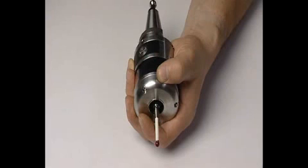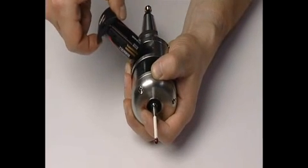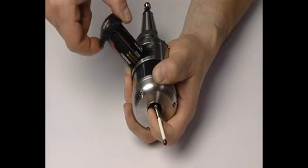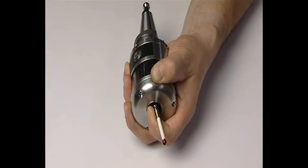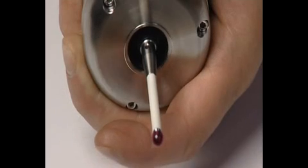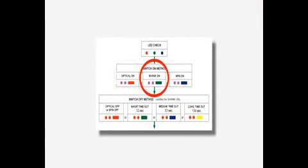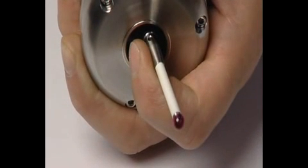To enter the OMP60 trigger logic settings menu, remove the battery cassette for 5 seconds, deflect the stylus, and, keeping the stylus deflected, replace the battery cassette. Once the review sequence is complete, 5 red flashes will occur. You now have the option to change each mode by deflecting the stylus for about 1 second. To move to the next option, the stylus should be deflected for at least 4 seconds.